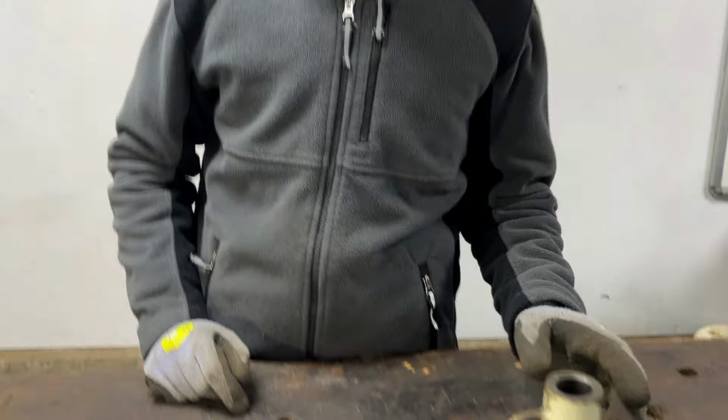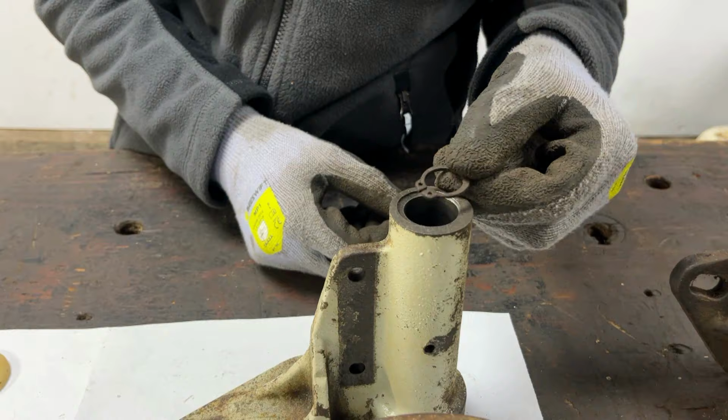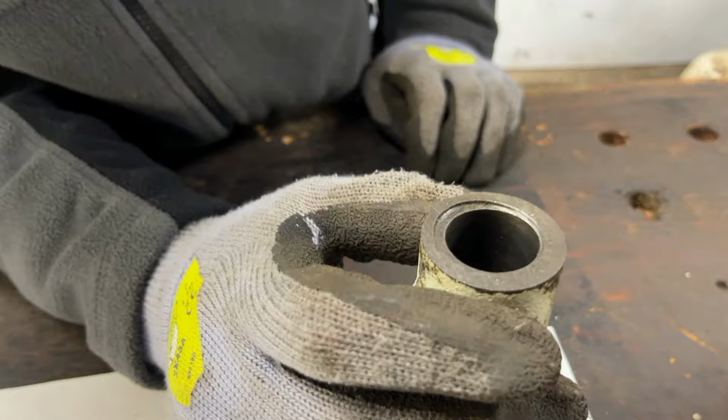Before we start on the seal washer, just something that we noticed while we were cleaning this PTO up is this horrible indented part on there, which shouldn't be there, by the way. We think that is from when the bearings would have gone in the other end. That shaft would have been flailing about everywhere. We think this circlip dug into there. The radius of that circle matches the outside of that circlip, so that might confirm our theory partly, but with that spinning around in there, it's taking the material down quite badly, and that's something we're going to have to combat or counter when it comes to putting the new bearing and oil seal in there. However, that is not today's problem.